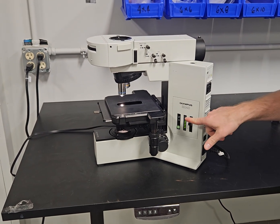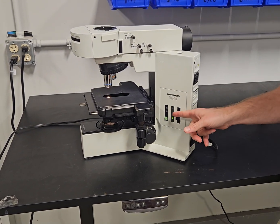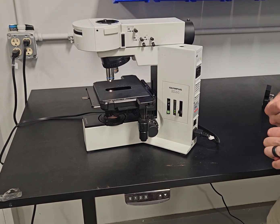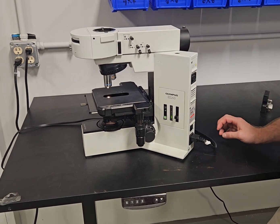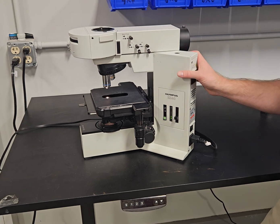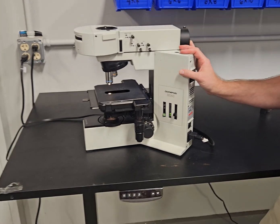You notice earlier this thing had no lamp house in it and it was all the way illuminated because there was no lamp house, the socket was bad, or it had no bulb. Now we've replaced it with a good bulb and a good socket. The bulb is a six volt, 30 watt. I'll put a link to those in the description — we have replacement bulbs for this scope on our website.